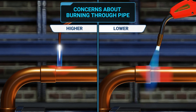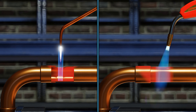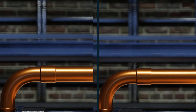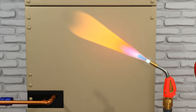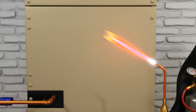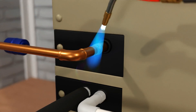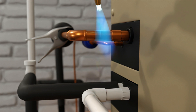Because the oxygen acetylene is higher intensity, it requires more care not to burn through the copper. When using air acetylene, you have to be aware that more heat projects convectively from the torch, meaning heat extends further beyond the tip than it does with oxygen acetylene — it's not as concentrated. This means you have to take more care to protect the work area behind where you're brazing. Oxygen acetylene is more precise with higher temperature, while air acetylene projects more heat out convectively and may require more protection behind the work area.